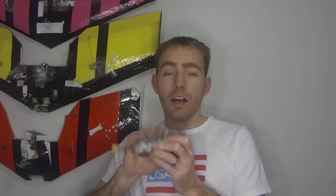I'm well under half of the constant discharge rating, because when these packs get lower, their voltage sag gets extreme. I've had a few flights where I was flying around at 8 amps — the constant on this pack should be right around 12 amps — and at 8 amps I was already seeing a 15 to 20 percent sag in voltage.